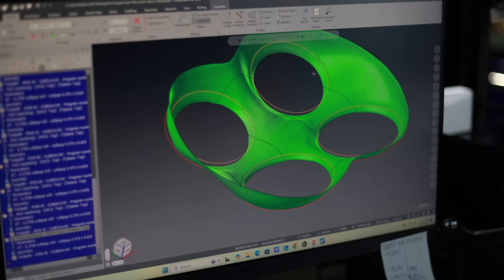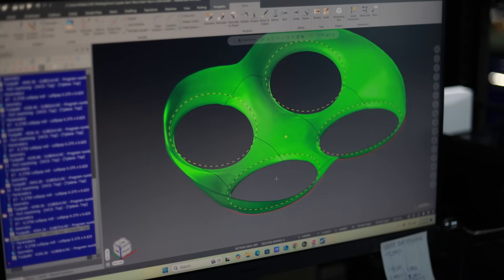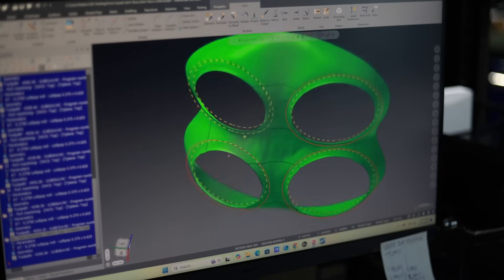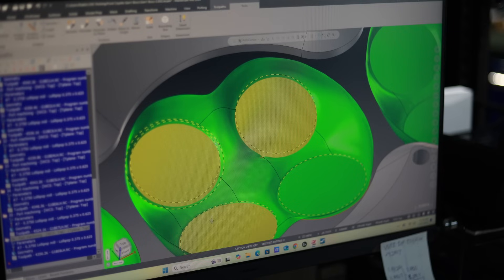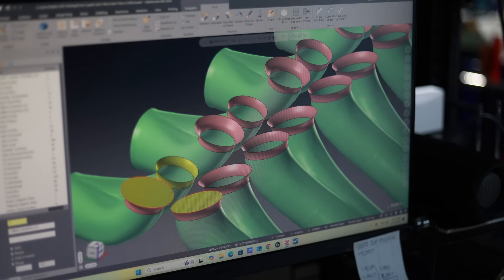Now that we have the chamber profile built out, we're going to utilize the data that came in from those valve angles. This data comes in from the machine based on the angle you set and how you set up the digitize. From these profiles we're actually going to blow them out — I make them 10% larger — and they give us this ring that I can bring underneath the valve seat angles so you can start building other surfaces. These act as containment geometry for the cutting process to make sure the tooling doesn't go underneath or into the valve seat. In similar fashion, we're going to utilize those same planes at the top of our digitized data for the port, and we're going to be able to chop off the seat from the port and make two separate surfaces so we can tell the machine: don't cut this area at the top, only cut what's underneath.